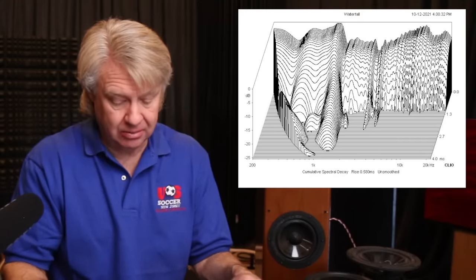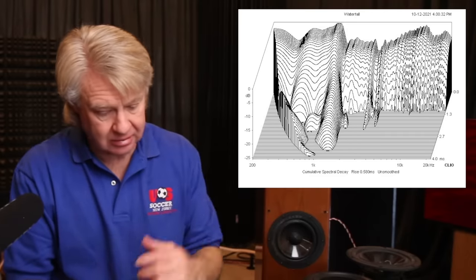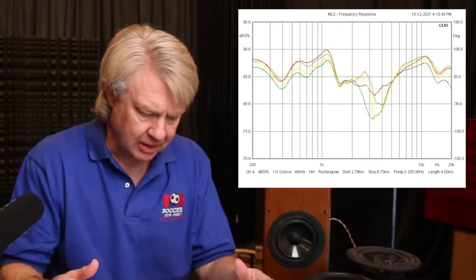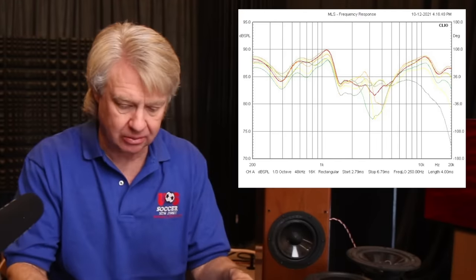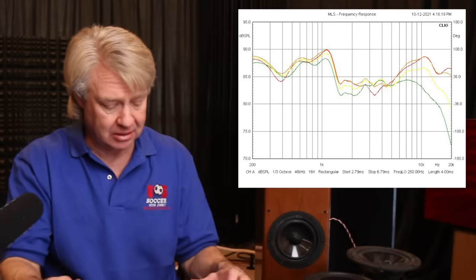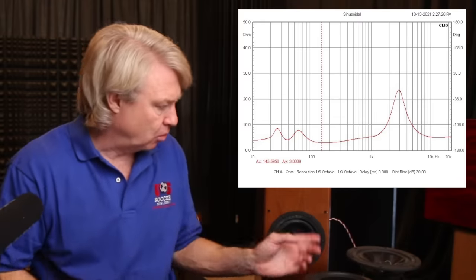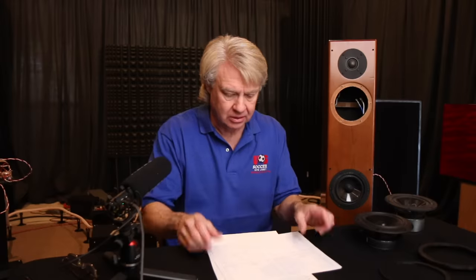Let's look at the spectral decay. Right off the bat you can see some of those peaks in the woofer's response are horrendous — there's ringing, breakup, and it just keeps going. This would be incredibly hard to listen to. The vertical off-axis has a little dip at the crossover point, but it's minor compared to how rough the frequency response already is. The impedance response dropped down to around three ohms — some of these woofers were wired in parallel, giving a pretty low impedance curve.